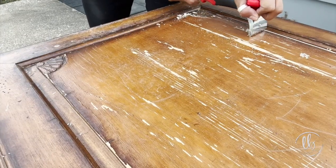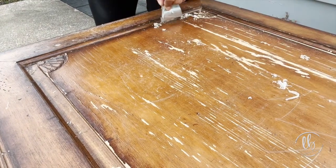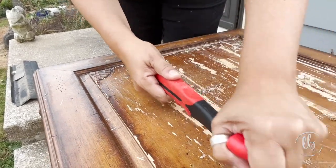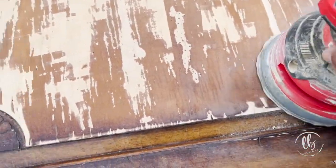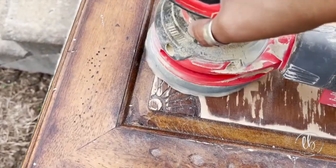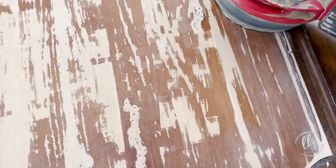I love using this carbide scraper. I purchased it at Lowe's. I'll put the link in the description. It just helps get some varnish and some stain off before you have to sand. And as you can see here, especially around the edges, it was really puffed up. So I really did have to sand it really, really well and get that to level out a little bit.